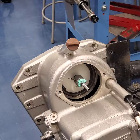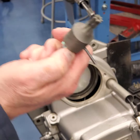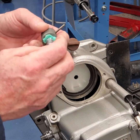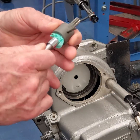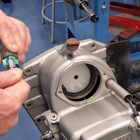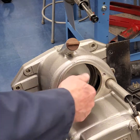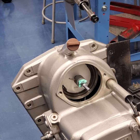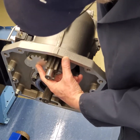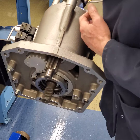Easy enough to take the SUS unit out. I want to show you a little trick I made up: pull the gear off the IPS SUS unit, drive the pin out — I didn't want to lose the pin — and I found a piece of steel off an old tool that was a little loose. I wrapped some latex gloves around it, worked it in there, and it's tight enough to fit inside where the SUS gear goes. I can use an electric drill to spin it, because I need to spin it to get to the other bolt hole on the other side.